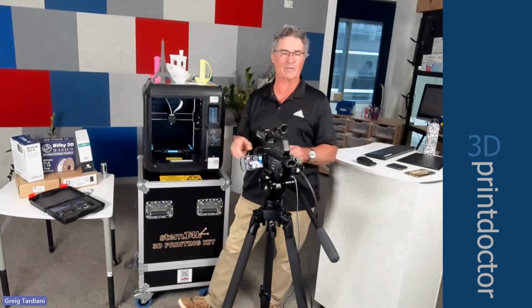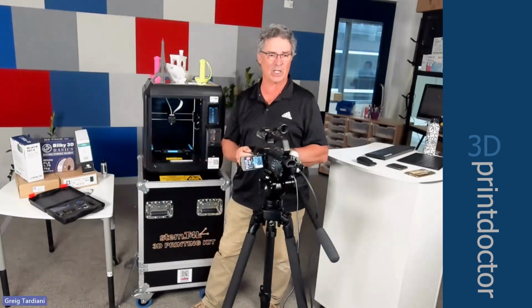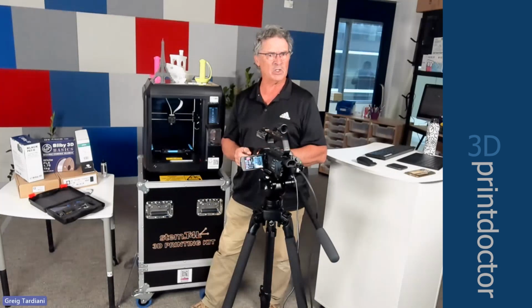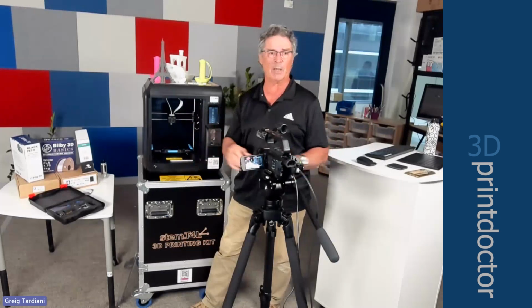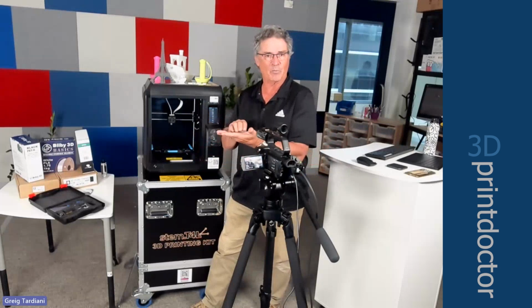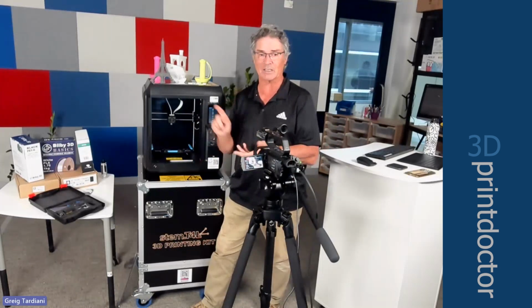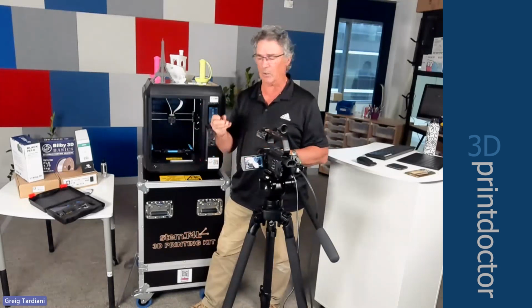Another thing is last Friday, I went down, simply because I was in the area, and dropped into Shan, who was on here, not here today. She was down at, I think it was Newbridge Heights Primary School, and she had some of the old purple printers and was using them there. And we got all three of them up working nicely. But she had issues with the beds not adhering. That was a leveling issue. That's important. Make sure it's level, level, level. And bed adhesion is the thing that's going to help.